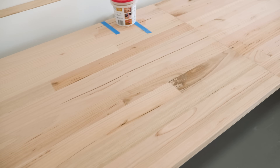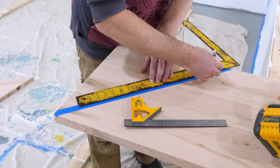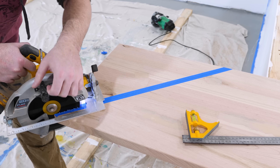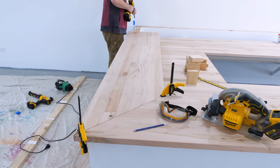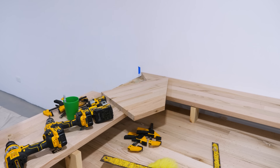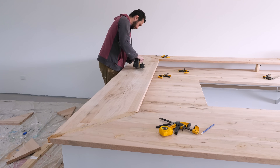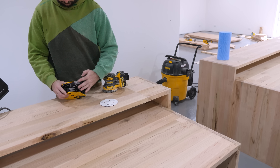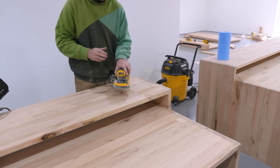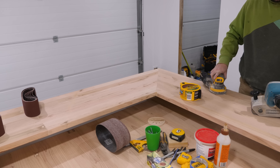Here is the main desk all installed — quite a bit of desk space. The narrow one-meter gap between the left and right sides lets me swivel between test systems. Now doing the top shelf where the monitors go, using a circular saw with masking tape to prevent splitting the timber. Using liquid nails and batten screws to secure it — it'll be strong enough without extra legs supporting the monitor overhang. I filmed way too much sanding but it really does improve the finish.